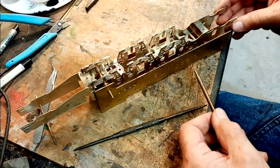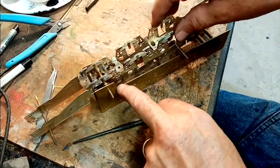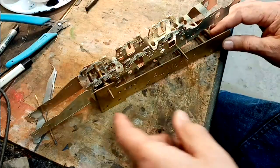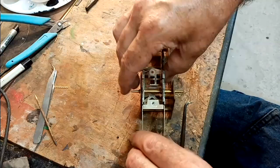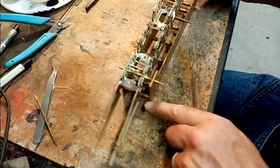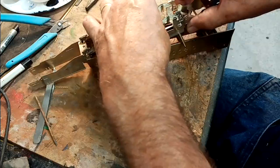Then I'll put a spacer underneath so that the top of the chassis is resting on there. I know that the top surface is aligned at the back, and here. So at that position now, it is perfectly level. If you look to the side, I'll slide it over. You can see that it's also parallel to the frame. You could sellotape a couple of little steel spacers on one side to hold it away from the bush, but I don't normally bother. I just make sure they're clipped in place now.